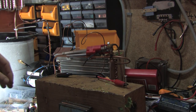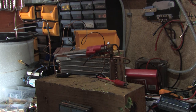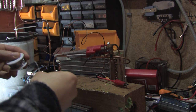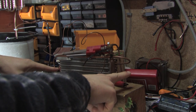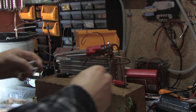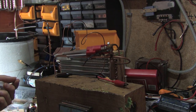The wire we're using is 0.5mm — the stuff I was using was 0.25mm in the last element. To straighten it, we've got two screws here connected up to a 12V battery, and basically all we're going to do is touch the wire against that to heat it up, and that will straighten it.